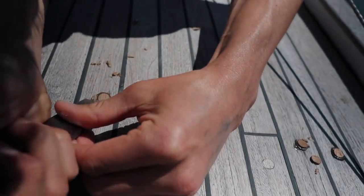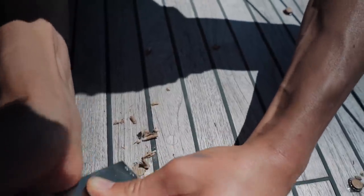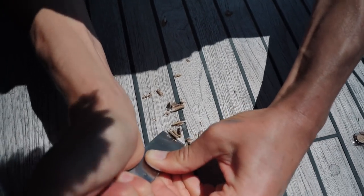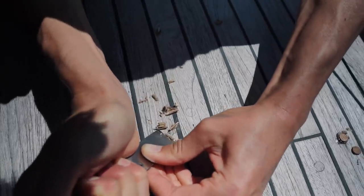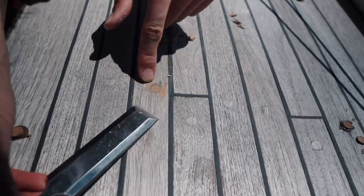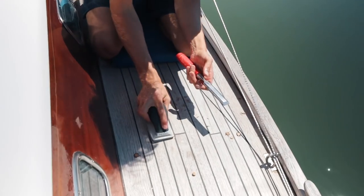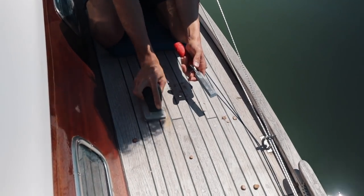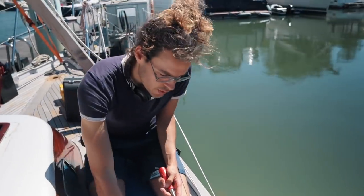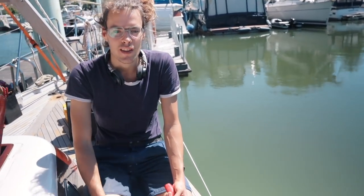So this one I'll continue from this direction. Here is the epoxy buildup I was talking about — I often make a cutting motion, not just uncontrolled thwacking with the chisel but actual cutting. At the very end you can go flat side down and go over it one more time so it becomes really flush. I skipped that part because the seams are a little proud and I don't want to cut into those — that's why I'll just use sandpaper instead.